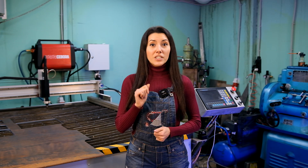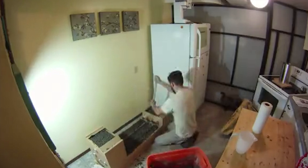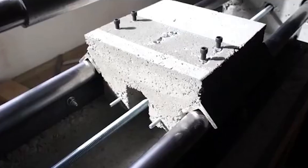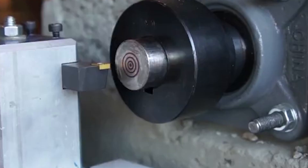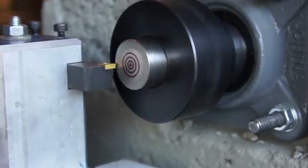Another famous lathe design is the concrete lathe. The first concrete lathe was developed during the First World War as an alternative to all-metal lathes when steel was reserved for the war effort. Concrete is inexpensive, abundant and easy to work with, making it an excellent substitute for steel in homemade lathes. Of several concrete lathe builds, Kurt van Filipovski's version caught our eye. Using plans from Pat Delaney, who brought the forgotten design back to light, Kurt's concrete lathe features a reinforced concrete lathe bed, headstock and saddle. He then mounted a second-hand 1.5 hp motor to drive his machine, with the remaining components fabricated from steel and aluminium. If you have a limited budget or lack access to steel, this one's for you.